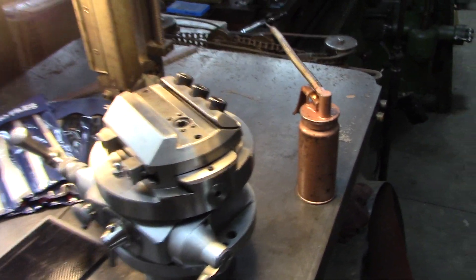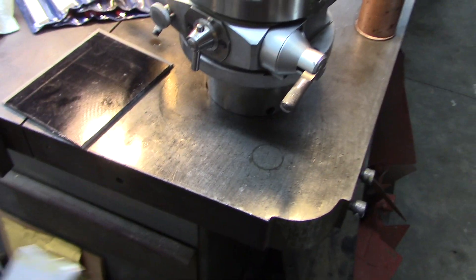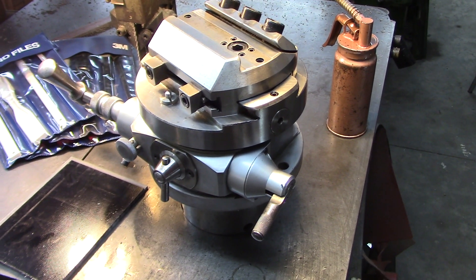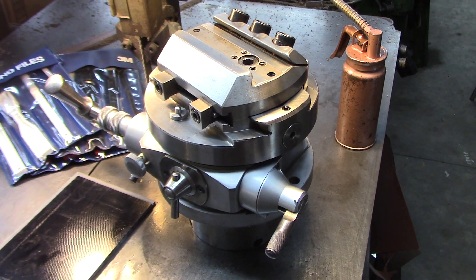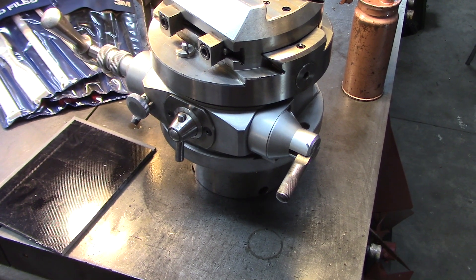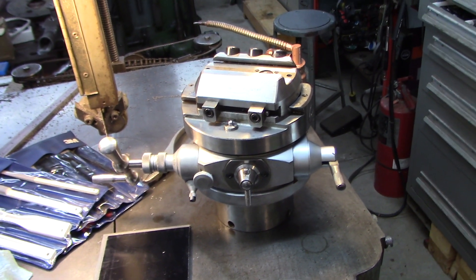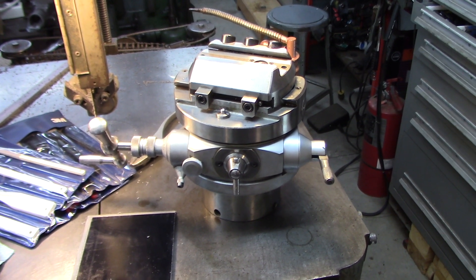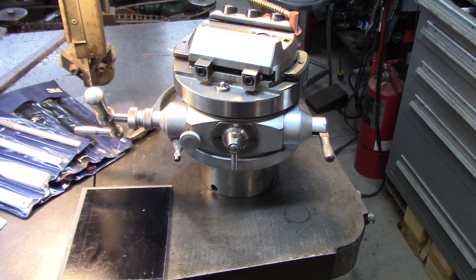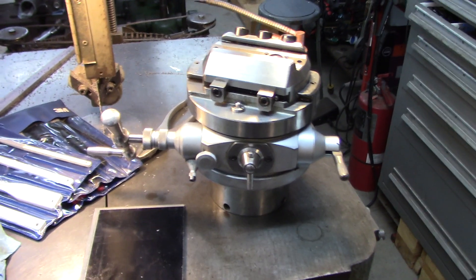I wish for the money it would have come with some accessories. I could have made that adapter on the lathe, but how long would that have taken? Three or four hours jerking around trying to measure, cut, re-chuck — precision threads on two ends, you have to re-chuck it to do it right. Maybe a four-hour job to make that adapter, and you want it concentric within less than half a thou, because the whole thing orbits and if it's off it just looks jiggy.